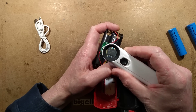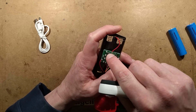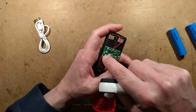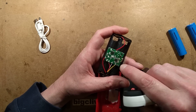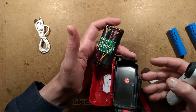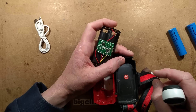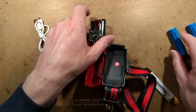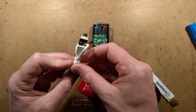4056A is the bog-standard charging chip, but it's good to know it's got that. And it's also got that auxiliary chip there to show the level — that must also be receiving the signal back from the torch itself, the actual front of the unit, to actually turn those LEDs on.